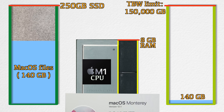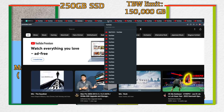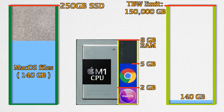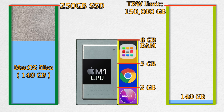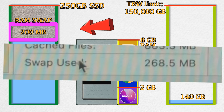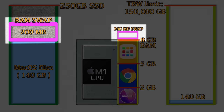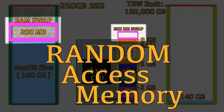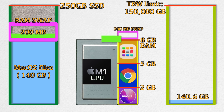When you boot a MacBook, macOS allocates around 2GB of RAM. Opening many Chrome tabs consumes another 3GB, and opening multiple apps simultaneously spikes RAM usage up to 8GB until there's no free memory left. At that point, macOS starts to swap a small portion of the SSD as RAM — that's the 200MB swap you see in Activity Monitor. That small portion is always coming from the SSD and will never be part of physical RAM.